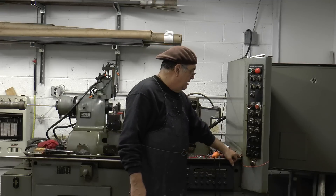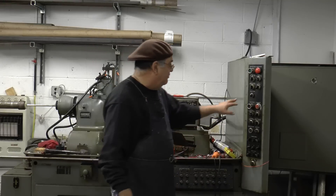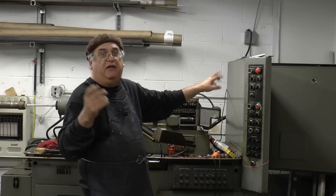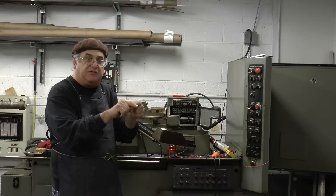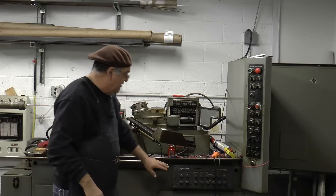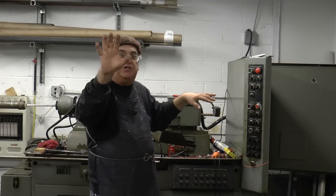We rigged up a button here to cycle it automatically, so if I want to skip a cycle I just push that button and it'll automatically skip the cycle when setting it up. I'm going to put that button right up here on the panel. These down here are hydraulic needle valves — they're feeds — so it allows the parts to run faster or slower. That's all the feeds here. You have the stops here and all the stops back here, just like on a regular turret.